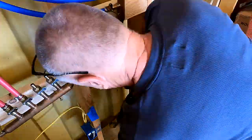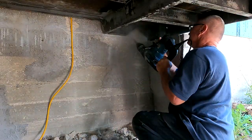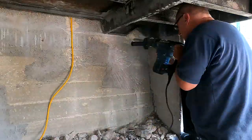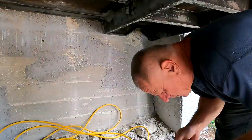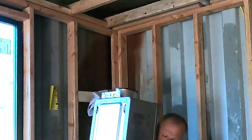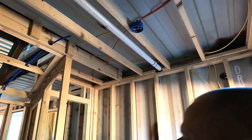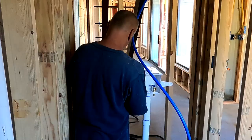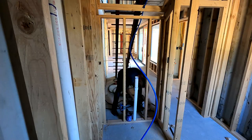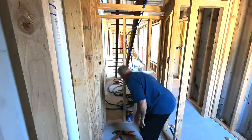I'm doing the holes in the garage - it'll run out underneath the container for the supply lines. I had to chisel out some of the concrete. The one on the left where the power cord is, that's the supply line for the water, and the other is where the gas is going to go. I tested the pipe fit and then converted back to PEX stuff, cutting the hole between the containers between the bedroom closet and the utility. You can see how easy it is - no joints, just smooth flow. I bought a bunch of 90-degree joints and T's and I'm using very few.